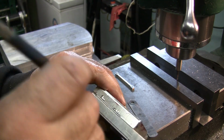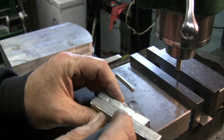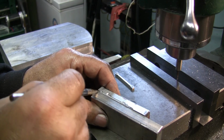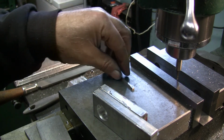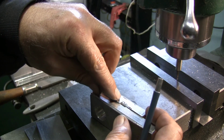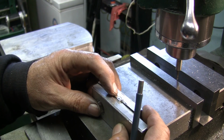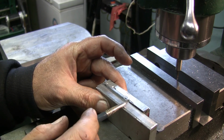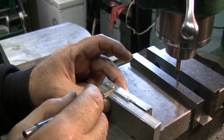You know, both together. And I came in with an 1/8 inch end mill, and I caught half of one block, half of the other block, went down 50 thou and out. Then I adjusted it down another 50 thou and came in on the end and made an undercut here. So now I can take the connecting rod blanks that I have made and put them in there and load them up, and it'll pinch on right here and right there, and I can go and cut my 15 thou.